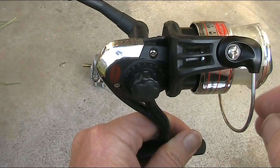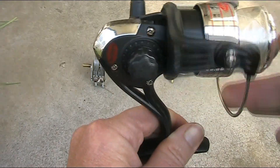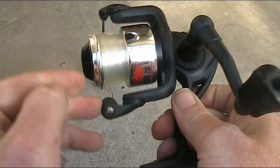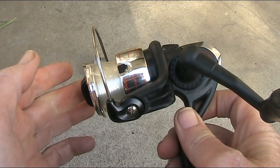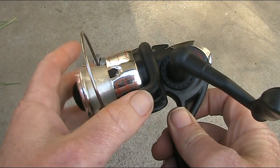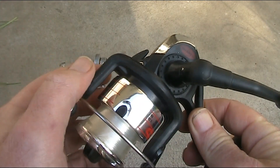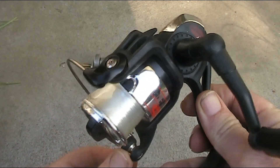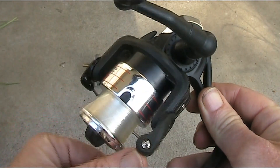Now another thing worth noting: if you turn this clockwise, this end turns anti-clockwise, while from the other angle this side turns clockwise. So you have the option of either anti-clockwise or clockwise movement depending on which side you mount your variable capacitor. That can be handy because it affects whether you tune from low to high frequency or high to low when you go clockwise — and generally speaking, you want to tune from low to high frequency when going clockwise.